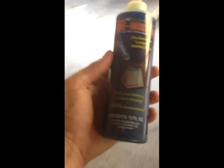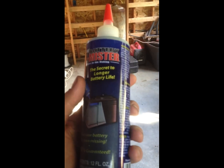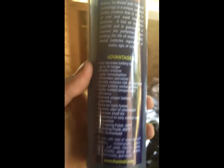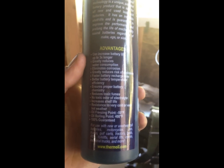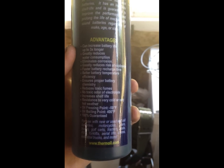This little magical item here, I just found out about — it's called a battery oil demister. You put about 4 ounces in each battery. It sits on top of the battery, and it does a lot of things, but the idea is it doesn't allow the electrolyte or the sulfuric acid to off gas — it traps them, and only hydrogen is released, and that then goes up this tube and out. We're going to pop a hole in the wall there.